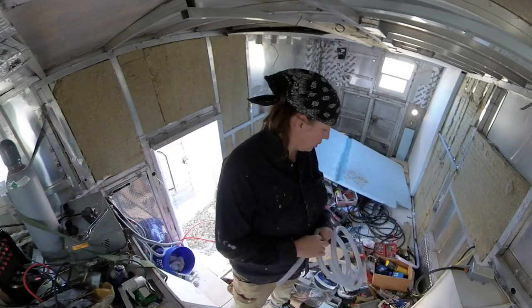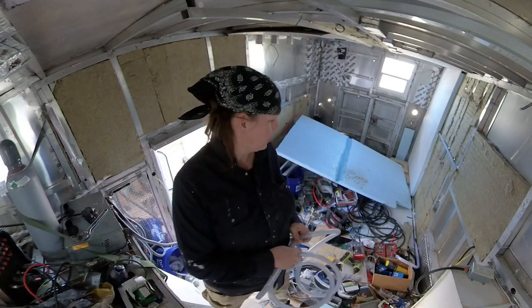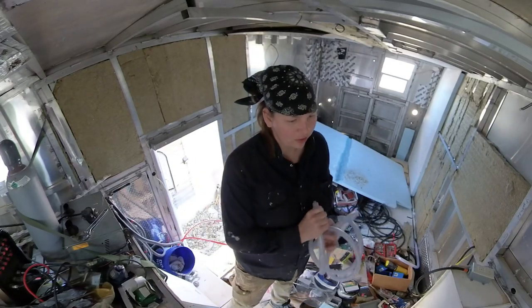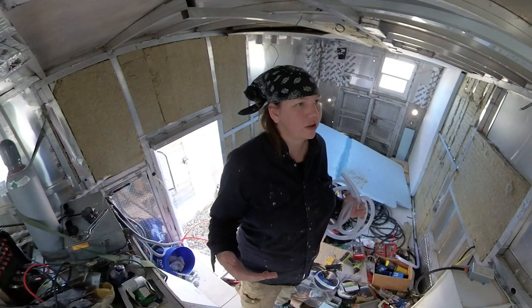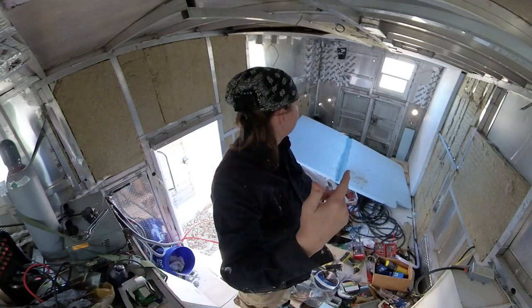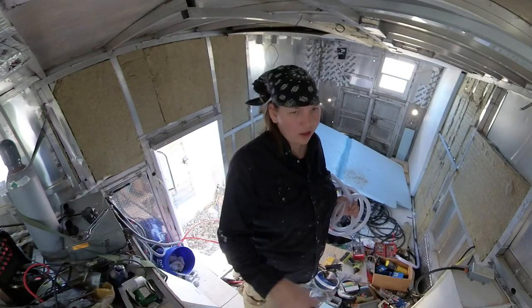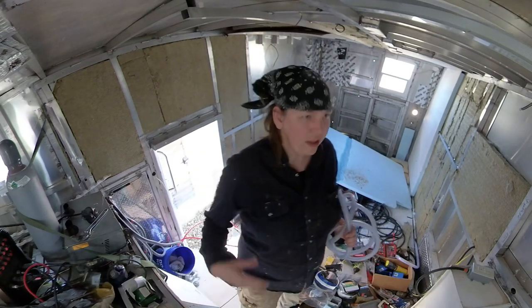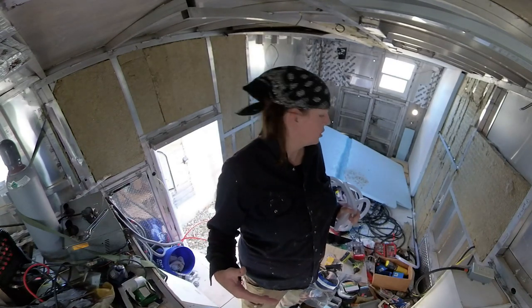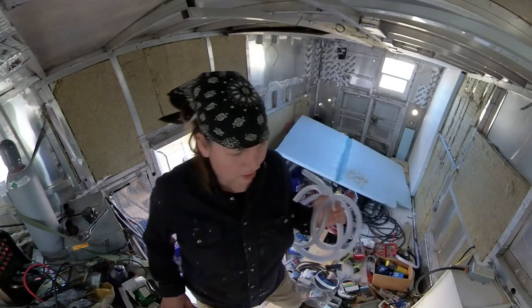Part of the reason I did the raised floor was, for one, I get to keep all my tanks inside where they're safe from freezing, because I'm warm, they're warm, kind of thing. For two, we can run all my electrical and plumbing and make changes to it as I see fit whenever I want to. Normally you have a switch, you turn it on and the power runs to the switch and up to the device. The electrical is going to be run through a switch panel, which means everything runs back to the panel. The control wires control the panel, which turns things on and off. It's that way for future use, mainly because I want to make my rig smarter than what it is. But I need a dumb solution to make it work. And by smart, I mean electronically smart, not stupid in general terms. Kind of like a smart switch.